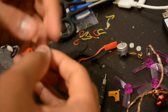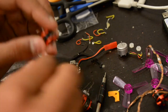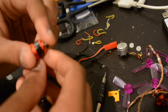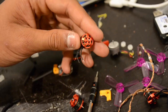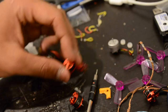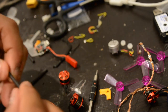Right now I'm going to be extending the wires on these motors. They're some cheap but reasonably effective 1104 7,500 kV motors. They came with this weird enamel wire which is not really ideal for soldering. We're going to go through how I'm going to extend these wires as the first step of the build process — obviously you need to have the motors primed and mounted.